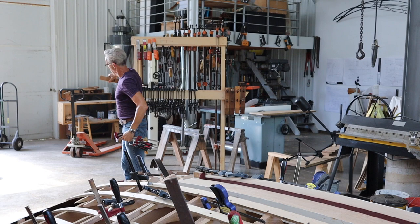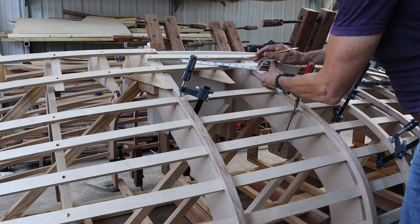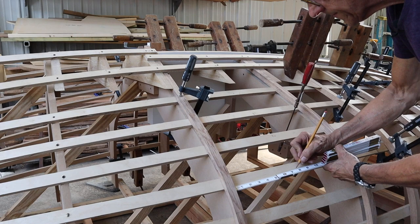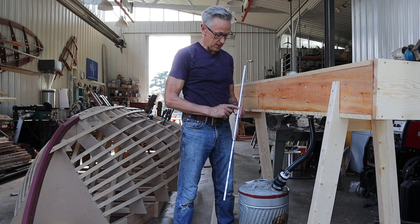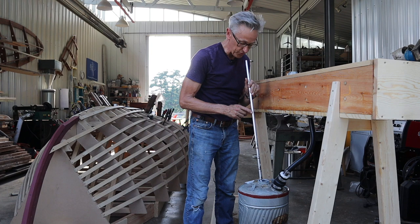On these in-between spots where there's not a mold frame, I'm measuring over the 7 1/2 inches that will be placed in the center. I put a little X so I know that's where the frame needs to sit. One thing for sure is you can never have too many clamps. One of the things you do not want to do is run out of water in your boiler. I have this measuring stick, which is just an aluminum tube — I picked up this tip from a shipwright named Lou. What you do is you lower it down and blow on it, and as soon as you hear bubbles, you know that the top of the rod is in the water.